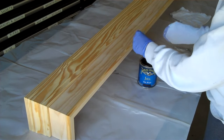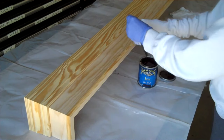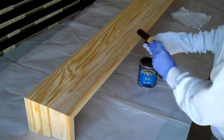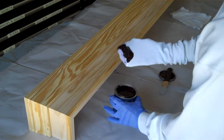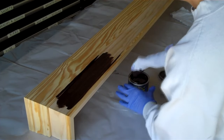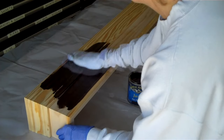A couple of tips using the Java Gel Stain: you don't want to put it on too thick, unless you're treating it like a paint. If you're doing it with a paintbrush, a thin coat works, but if you're going to use this method, you don't want to put it on too thick. So, put some on your glove and just go for it — rub it in really well.